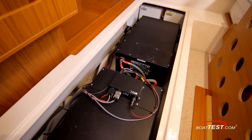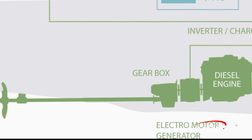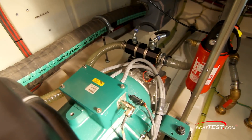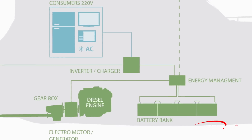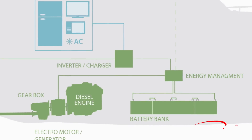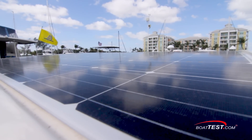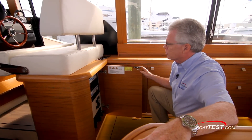The batteries are down in the guest stateroom. The hybrid system is quite simple: if you follow the propeller up, you come to the gearbox — same as on every other boat. That shaft continues ahead through the E-drive electric motor and then to the diesel. We get to switch on whichever one will drive the shaft through the gearbox. One draws fuel from the tanks, the other from the batteries. The batteries are recharged from either the diesels or the solar panels on the roof. That's it — simple. At the front of the salon there's a door leading to the ship's main electrical panel: DC on the top, AC on the bottom.